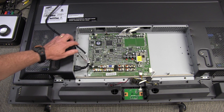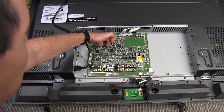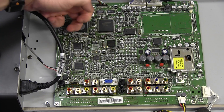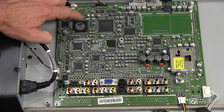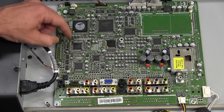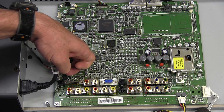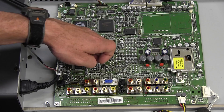I've got this thing turned on and it is actually powered up. If I do the old back-of-the-finger test — that chip there is getting quite warm. Let's zoom in on that. This is the old back-of-the-finger test. This one is hot, hot, hot! That's the main Samsung BGA part there. That's just the memory there. That's some sort of video processor — a little bit warm. That's the HDMI panel link, doing nothing, a little bit warm. We're just searching for any parts that are particularly hot.